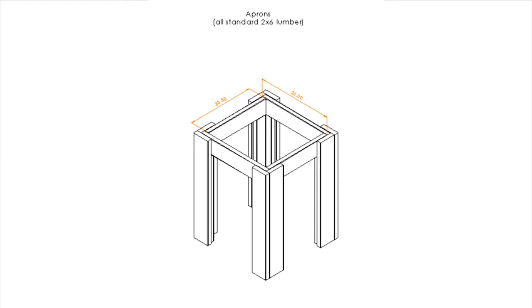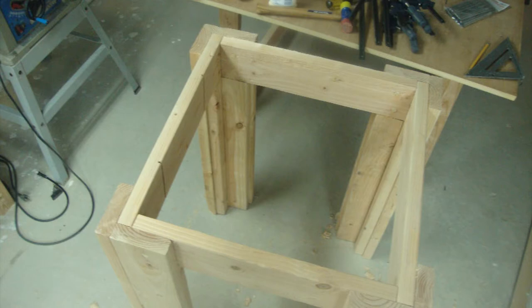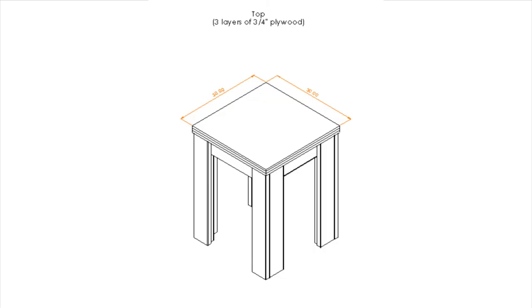Here you can see that front-to-back, left-to-right symmetry. The overall width ends up being 29.5 by 29.5 — though the dimensions in that picture are of the aprons themselves, not the outside dimensions of the stand. Here you can see my four legs standing together, and in the next shot you can see them with the aprons — everything is finished up at this point. There's actually a lot of glue squeezed out all over the place because I subscribe to the whole 'more glue is better' philosophy.